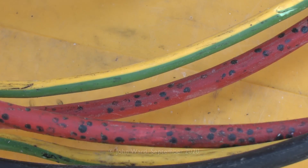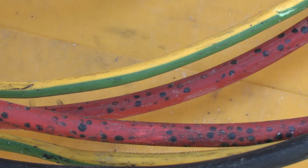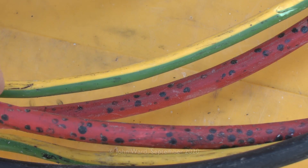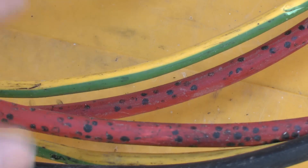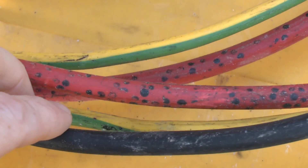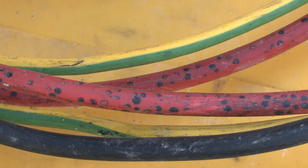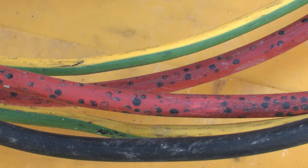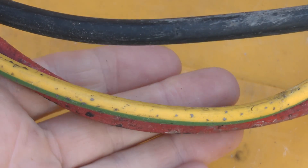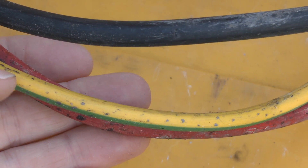If this is left, eventually the plasticiser comes out of the cable and it becomes brittle — the insulation will crack if it is moved. The other problem with putting cables through cavity wall insulation is that their current rating is significantly diminished because the heat that would normally be dissipated into what would be an empty space is now contained. That's mainly why you don't want to be putting cables through cavity walls — even if there's no insulation there now, someone can come along later and put some in. We can see a similar effect on the earth conductor here with the black marks all along the coloured insulation.